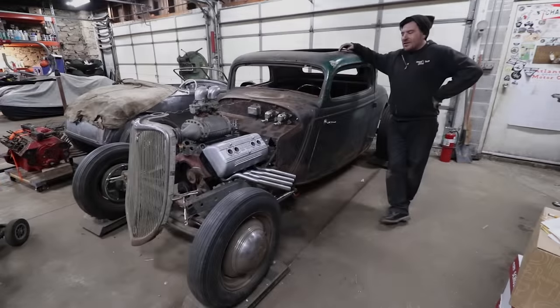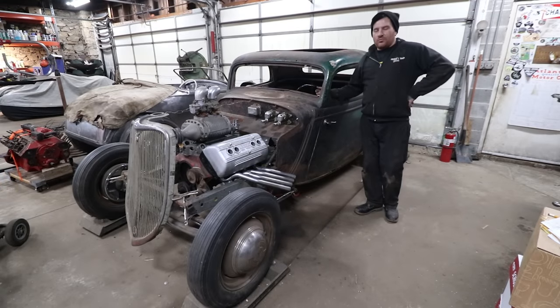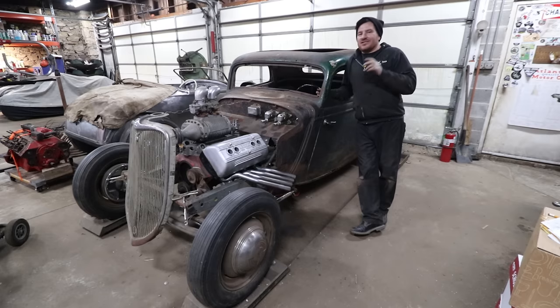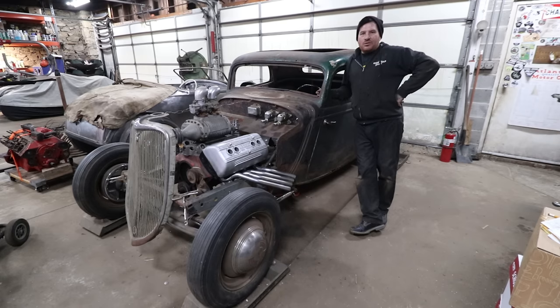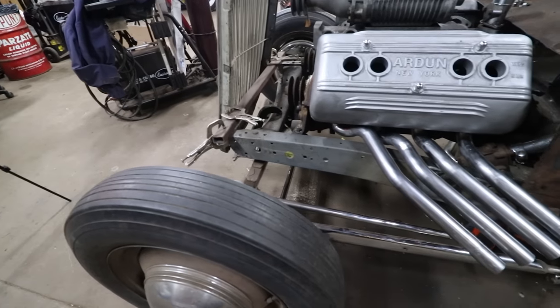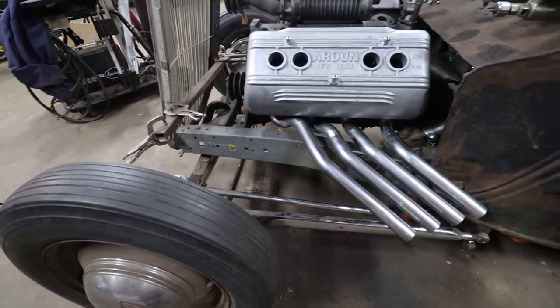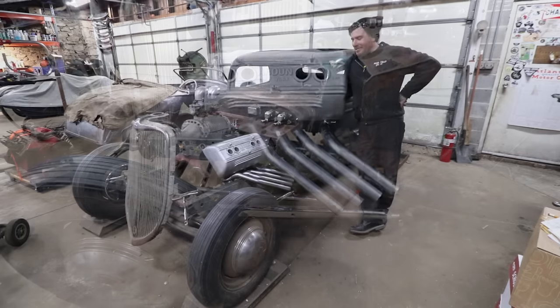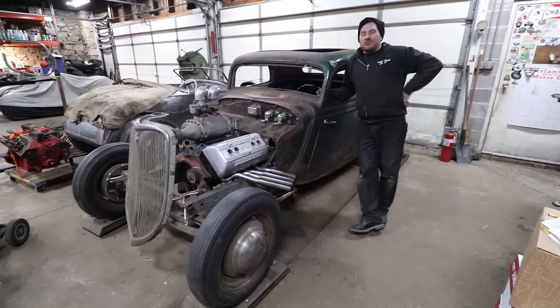All right, so I just did a quick little run with the sander, with both the little flap disc and a belt sander, and just knocked down the welds, and then took the mini DA and went over everything just to blend it in a little bit. Definitely some spots that need a little bit more work, but now it's all kind of one tone, so to speak. There's not all the marks from welding, and it looks pretty badass. Pretty psyched on it. This definitely gives that aggressive look we're trying to get for the car.